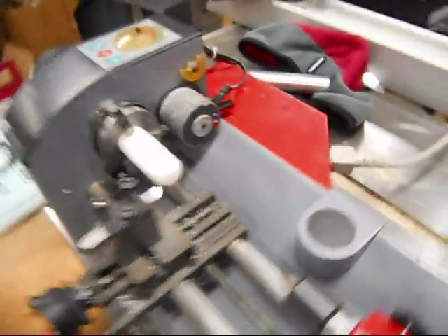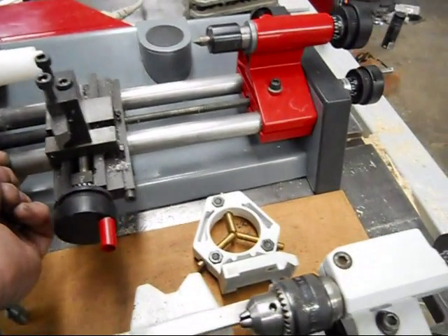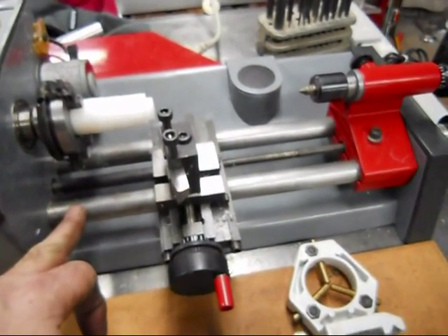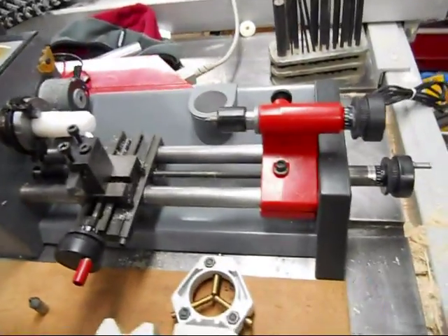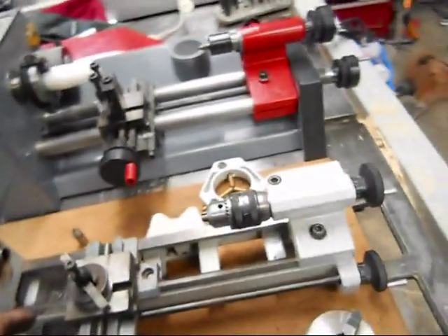This lathe is not going to be springy — it's much, much heavier construction. This is about a three-quarter inch diameter rod. These rods are much larger in diameter than on the DB and the SL Unimats. So it's a much better lathe than the smaller Unimats.